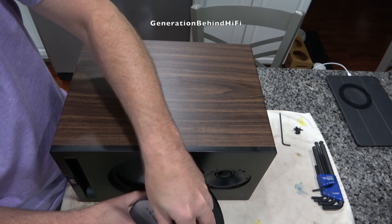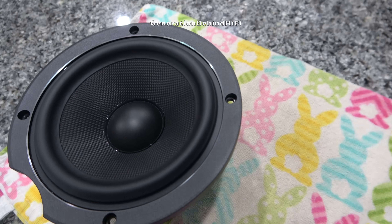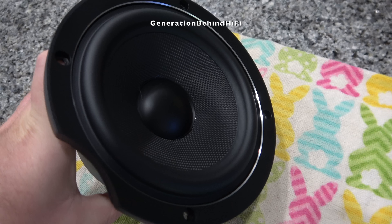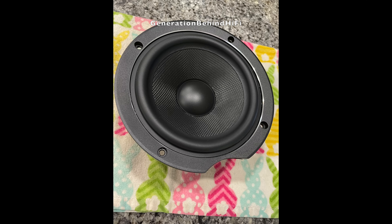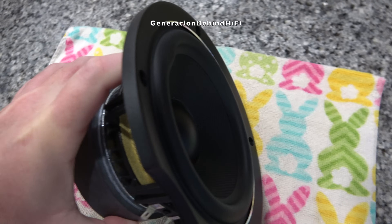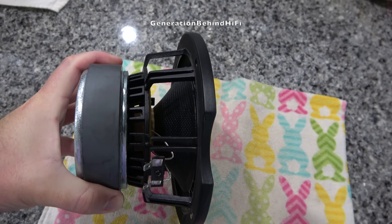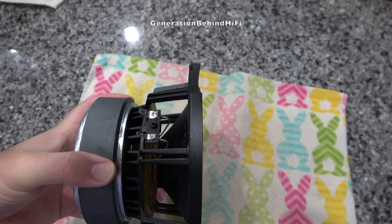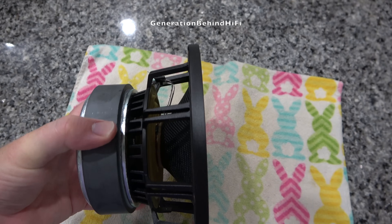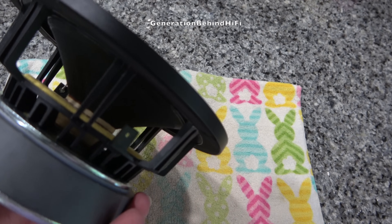Oh wow, I'm liking what I'm seeing already. The woofer driver out of the DBR62 is extremely nice considering the $700 price point. The driver features a butyl rubber surround and the cone is made from Aramid fiber. If you're familiar with Kevlar, Aramid is basically the same thing as both fibers share the same polymer structure. Aramid fibers are used in advanced products where lightweight and high strength are needed, and using Aramid as a cone material reduces weight while retaining high strength and providing good damping properties.